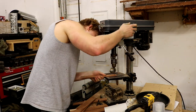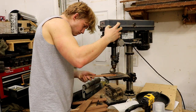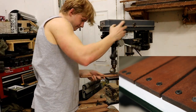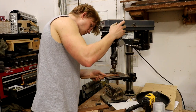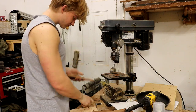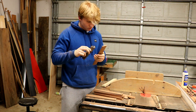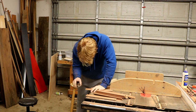Because it's a table I don't want the screws poking up. It's worth mentioning that whenever I put these screws in, I make sure the hole the screw itself goes through is plenty loose - that way it doesn't split the mahogany being so close to the ends. All the holding power is just in the half inch plywood. I'm putting a nice little chamfer on all these edges using the hand plane.